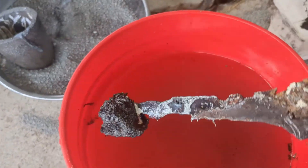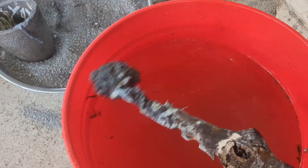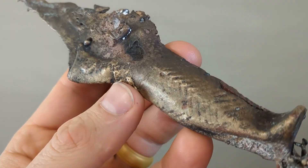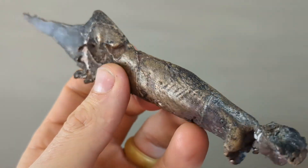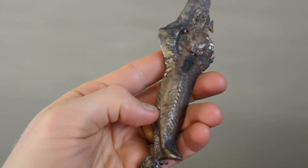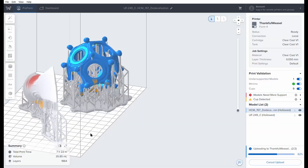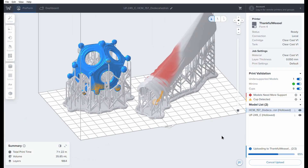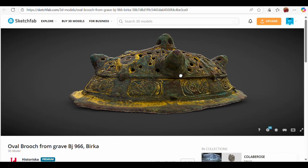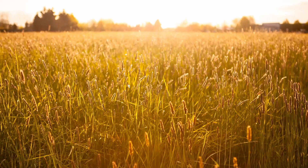This is not quite what I had in mind, but on the whole I'm reasonably pleased with this result. The thing with lost wax casting is there's a lot to dial in — I need to figure out how to get the burnout process to work much better. I have a friend who might give me a kiln soon, so hopefully that can improve. I'm going to be trying this again — it's just too cool to pass up. I'm looking forward to making and testing out artifacts including Roman dodecahedrons, more axes, and more fun stuff. If you enjoyed this project and like the zany fusion of old tech and new tech, please hit the like button, subscribe, and come back for more.